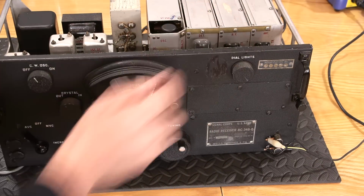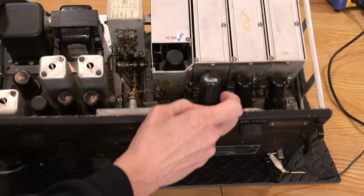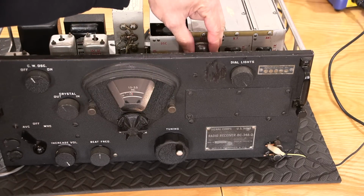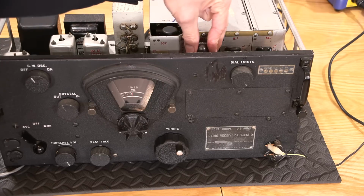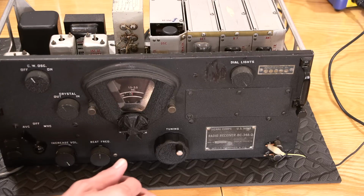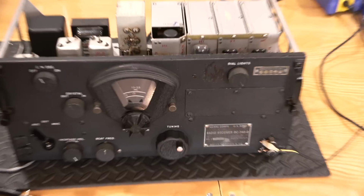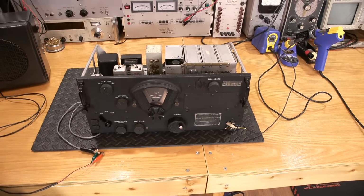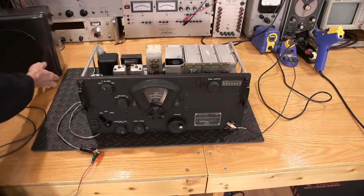Normally, this is the audio output tube. If you were to put your finger on it, you would have some pretty bad burns. And this tube here is, I would say, like filament warm, just gently warm. As you can see, I can very comfortably keep my fingers on this, so I imagine there could be something haywire with the B+. Maybe the B+ is low. Again, this is a home-built power supply, right? So who knows if this was even done properly from the beginning at this point. I hear nothing in the speaker, so I'll back this out and bring this up to my ear. Yeah, there's nothing coming out of the speaker at all.